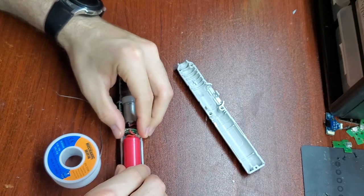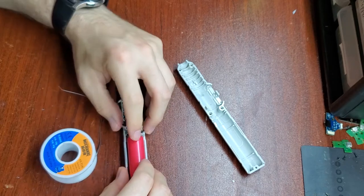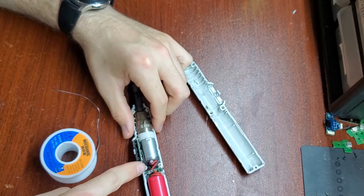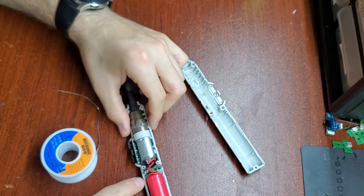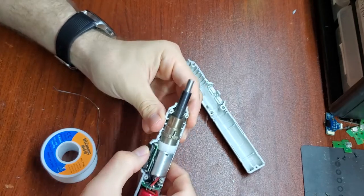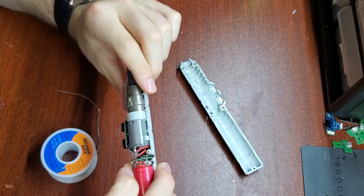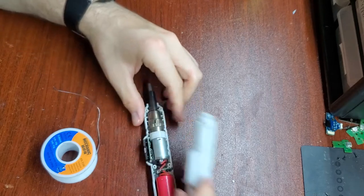One really nice thing I forgot to mention: the wires used inside here are silicone. That's pretty nice attention to detail — they didn't use cheap PVC wire. It could get hot in there from the amount of current being drawn, and PVC could start to get warm, warp, and maybe even melt and short against something. I'm going to curl that up and squeeze it in there, and just tuck that black wire down. From that little test you can see it is working, so the cell is in there properly.